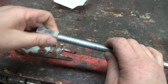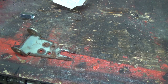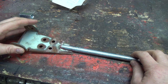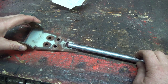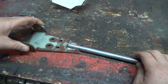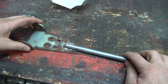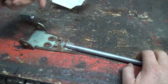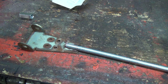I'm going to have to weld this, I think, on the machine. So I get this off. Ow, my toe. So when I get it welded, I get it welded straight, and it's in line with the pin on this bracket part here. So looks like I've got to just hog a little more out of there, and then she should be good. Although I think it was sitting kind of like that. But yeah, see, I've got to make sure I weld it this way, right? Or if I don't happen to get it bang on, the pin will go and hit over here. So I don't want that to happen. So I'll somewhat half assemble it here, and then we'll weld her together.